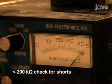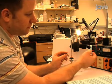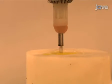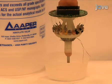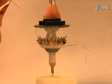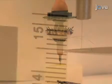If the impedance drops below 200 kilo ohms, this may indicate a short circuit. If after repeated pulses the impedance does not drop sufficiently, the electrode tip may be obstructed. Re-cut the tetrodes, check for shorts, and repeat the gold plating process. If re-cutting doesn't help, replace the tetrodes and start again. After plating all tetrodes, dip them in ethanol and let them dry for three to five minutes. Test for short circuits within tetrodes using the current generator with the tetrode tips exposed to air. If a DC connection exists between two or more electrodes of a tetrode, re-cut the tetrodes and plate with gold again.